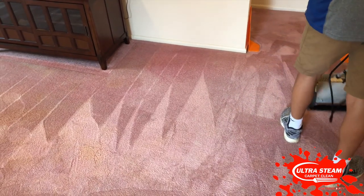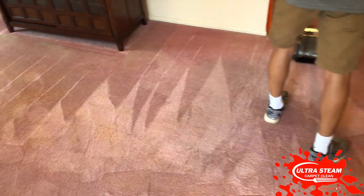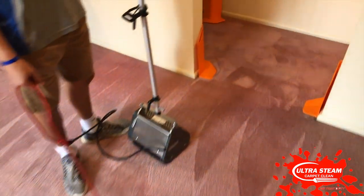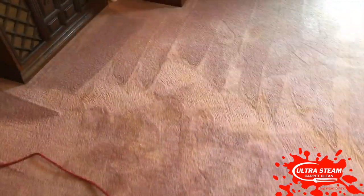Then we're going to pre-spray the carpet again with Soap Daddy BioSpray 08. I added a booster powder, which is a sodium percarbonate. So it's another oxidizer. It's another form of peroxide, just powder peroxide. And we're going to put that down, and we're going to see what we can get out. Again, maybe some color loss, but we do not want to leave any urine behind in these fibers. So we'll be back when we get to the extraction.